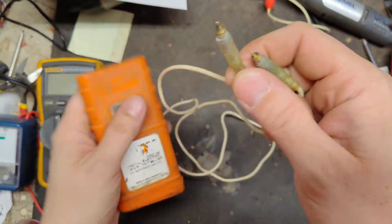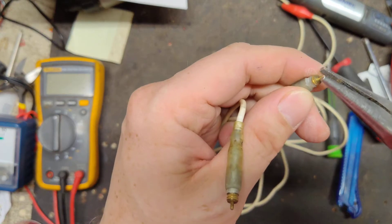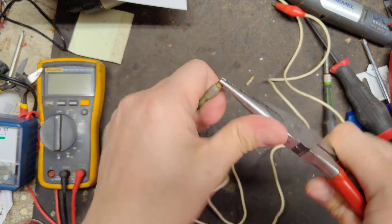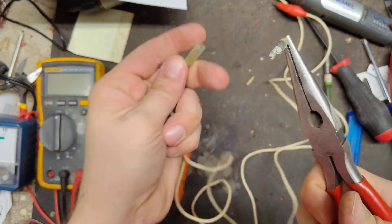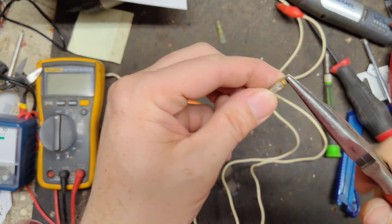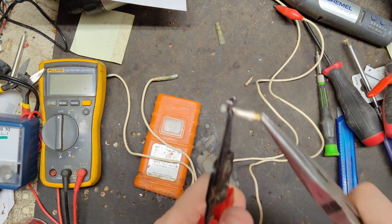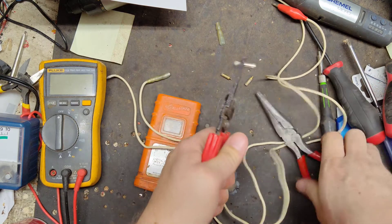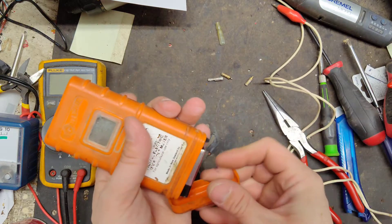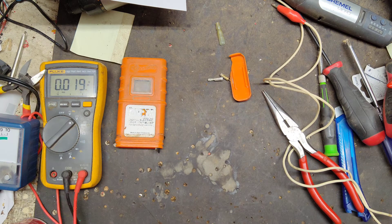I noted one problem - both of these little leads come out, and there's a little brass piece right there that's supposed to be on the board. I can see that broke - I think somebody's tried fixing it themselves. The brass thing and the little connector came off the wire. We need to fix all this stuff. I'm going to take the battery out - it takes a nine-volt battery. Let me check the battery real quick, make sure it's good or bad.